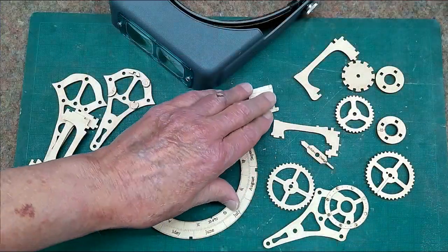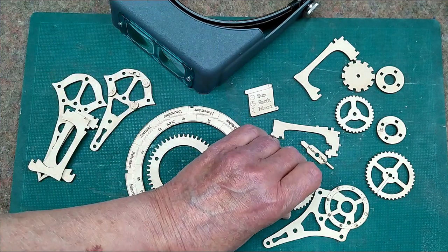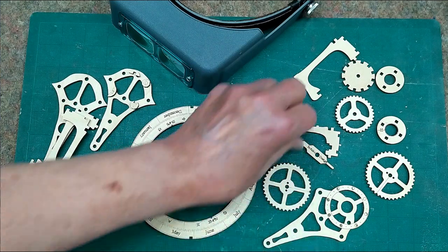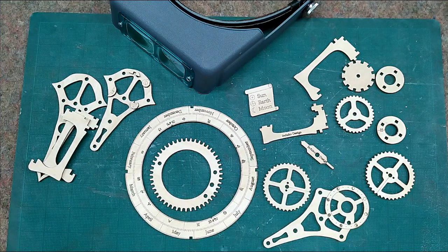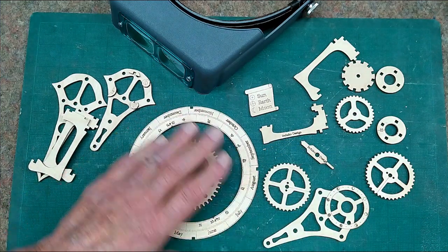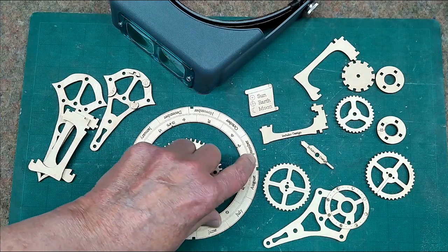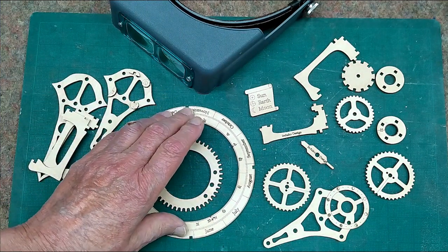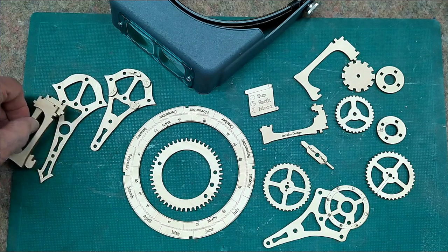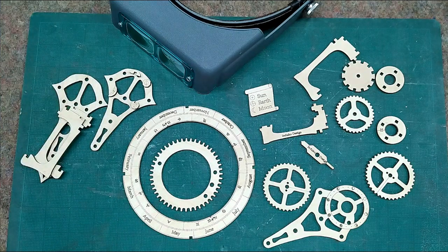All the pieces are cut out. A little magnification won't hurt, especially when you're trying to find little tabs you need to cut loose on the back side so pieces will pop out cleanly. Baltic birch veneer can be a little bit brittle, or you may find a spot where the veneer is not glued down as tight. Generally speaking, this is excellent plywood, but there were a couple of places where I had pieces come loose. I just glued them and let them sit overnight.